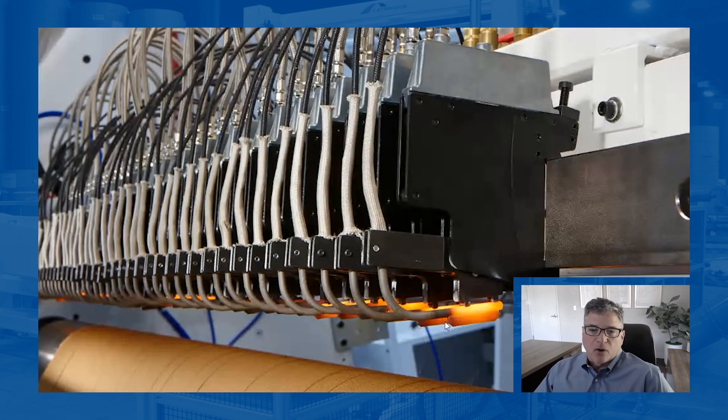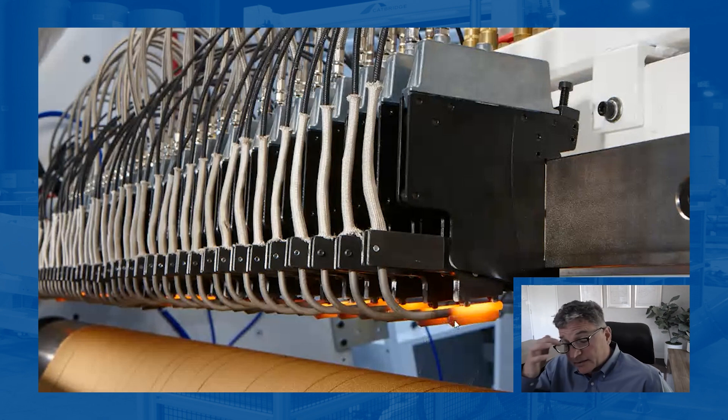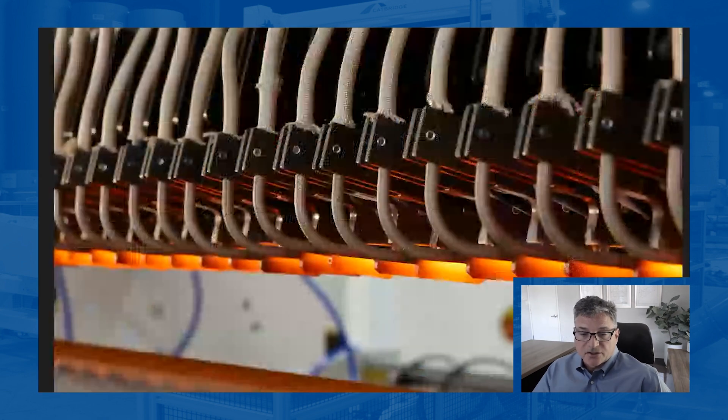The standard score holder can also be adapted for hot knife slitting. This picture represents coil rod style hot knives used for slitting fabrics. The idea is you're putting enough heat into the cut that you're sealing the edges as the material passes by — basically like putting heat on a rope. This is a static knife that goes into the score roll and heats the edges of the material as it passes. There's also a version of a round knife that's heated, working just like a standard score knife in the same holder, providing heat during the slitting.